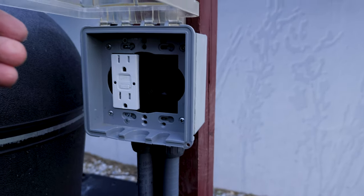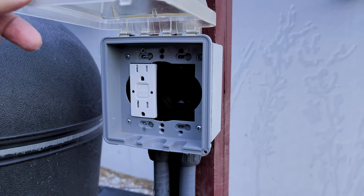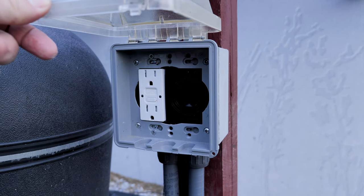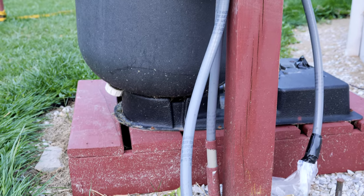When looking at the box, not much has changed inside except that I bypass power going from the house to the pool and I've actually just connected onto the new line going to the shed. All in all there are six wires inside this conduit — three that go to the shed and three that come back to the pool.